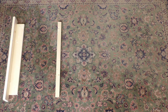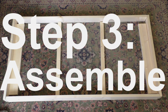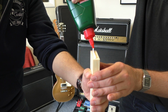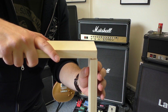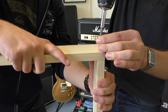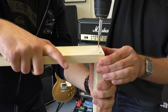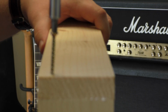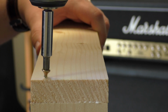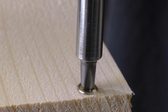The pieces that make up the panel should fit together like this. Now this is where your friend comes in handy. Apply a line of wood glue to the upright end of the 1200mm piece. Hold a 1200mm length and a 636mm length together and make sure all the edges line up. Now you need to fix the end in place using 2 40mm wood screws using your battery drill and Phillips head bit. Using self-countersinking screws is best. Repeat this process for all 4 corners.